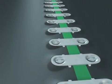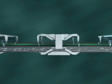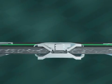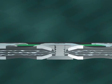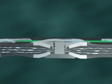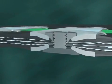Number 2 and 1.5 fasteners worked well on thicker style belts for which they were designed. But the thick cup of a number 2 fastener sinks deeper than necessary into a thinner belt, with the sharper edges potentially damaging carcass fibers and weakening the belt. The shallower cups of the newer style 190 and 140 fasteners ensure the plates sink the proper depth into the rubber, avoiding damage to the belt carcass and maintaining overall belt strength.